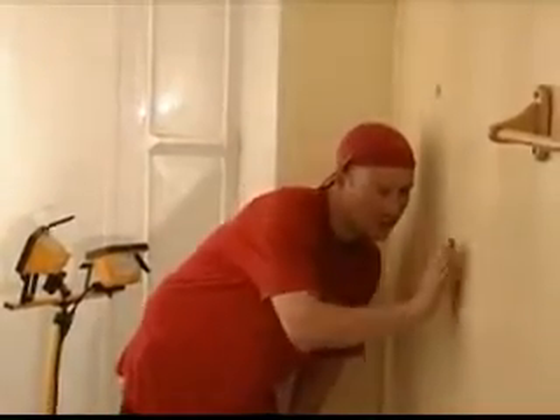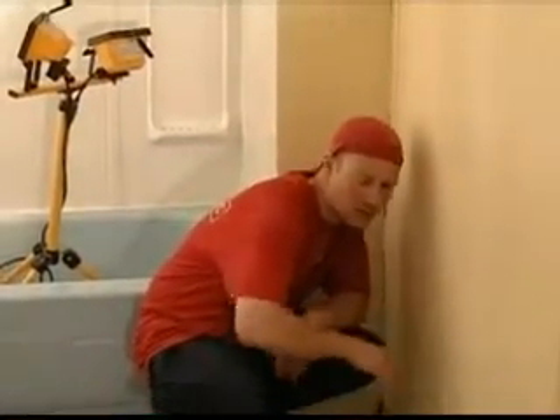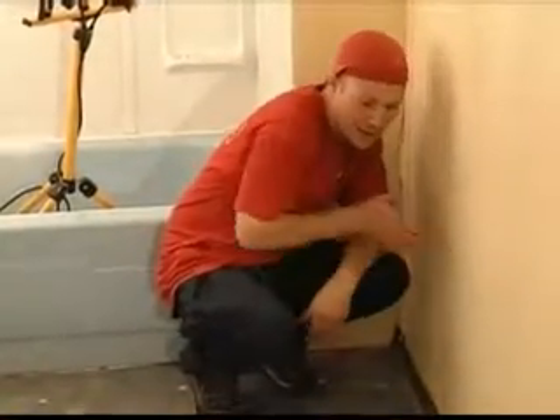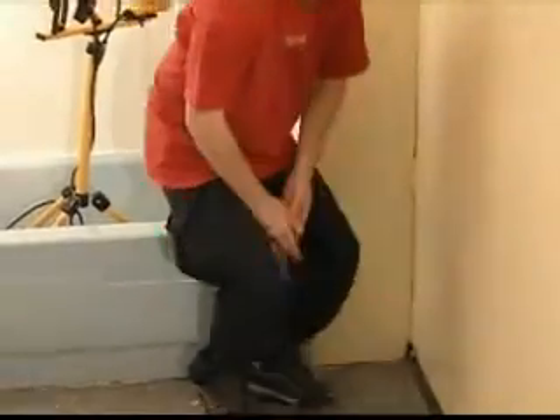This is the main wall. When somebody walks into this room, they see this wall first. What you want to do is look down it — close the other opposite eye and just look right down it. If you want to get down low, it works even better because you want to see close to the floor. I look at it and I see it has a bit of a dip in. It's not bad, it's generally pretty straight. I'm not too worried about it at all — I would definitely leave that.